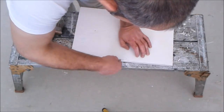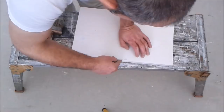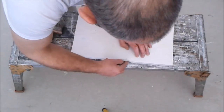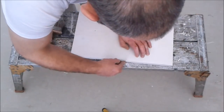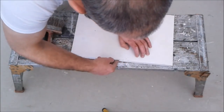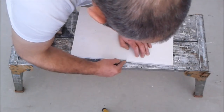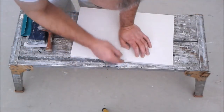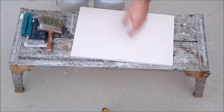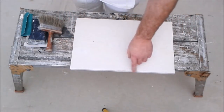So following that edge all the way along. And come along the other edge. That really will give a good anchor for the filler, especially if it's on a corner, on an edge, door casings and such like, where dogs have been chewing, or furniture when you've been moving has caught the woodwork.